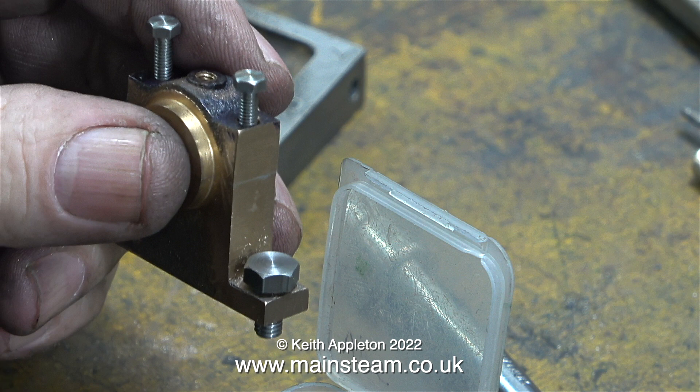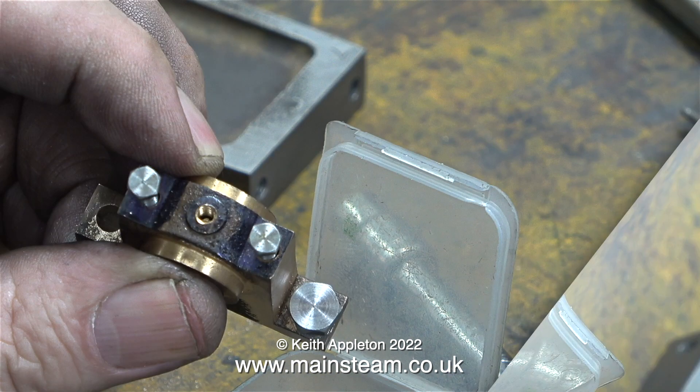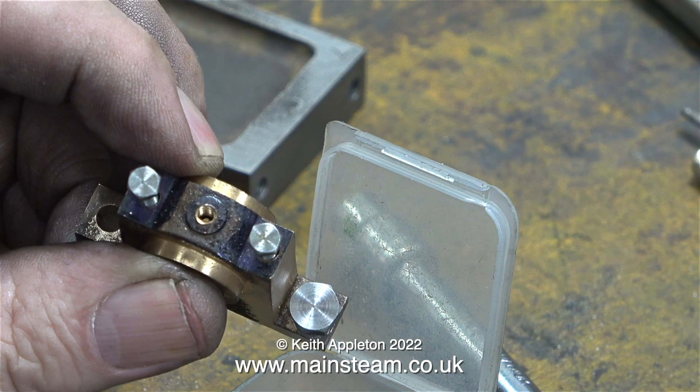Look at these. Now you see what I mean about zero tolerance. If the hole is not in the middle, you have a big problem — the bolt will not go in the hole because it fouls the side of the casting, and even if it did, it would be off-centre and look truly horrendous. Thankfully, I didn't get the holes in the wrong place, and once these bolts are tightened, they should look fine — if not a trifle over scale.